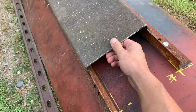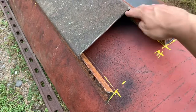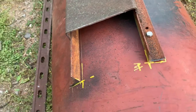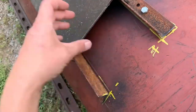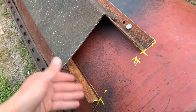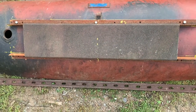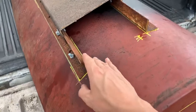I wanted something wide that would push on here so it wraps around both sides, and just drill holes through here and put a bolt through. I'm trying to do less welding than last time — last time I had a big tab on each side and you're basically pushing all the force into one little spot. So this time I'm spreading it out and trying to have a little bit of a backbone in there and a good piece to push on and to keep the plow nice and strong and straight. I bolted on some angle irons and tried to make them as straight as I could.